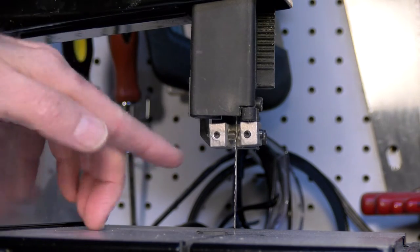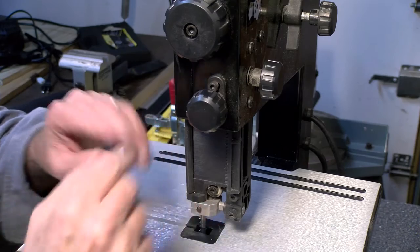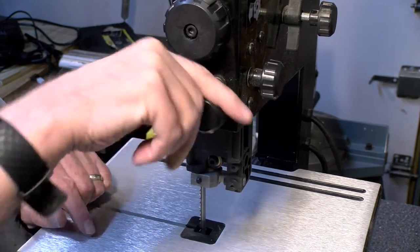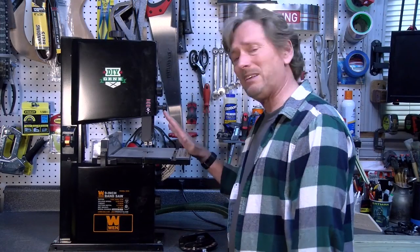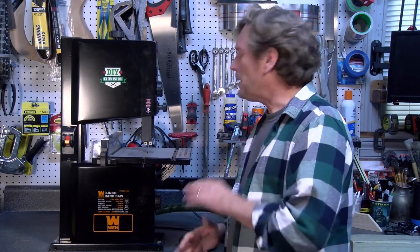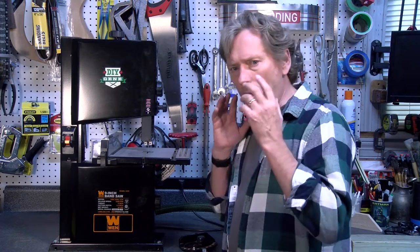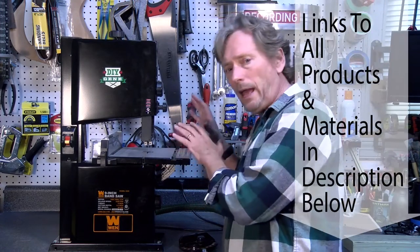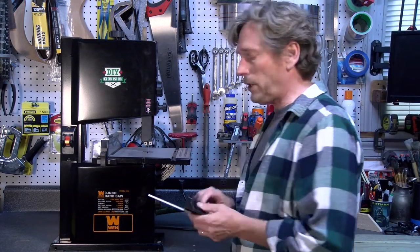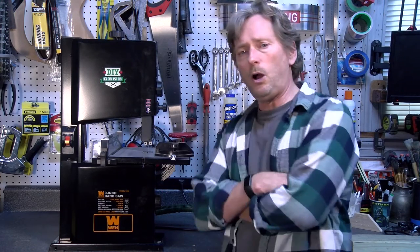Besides the tracking, you can fine-tune the blade back and forth with a set of allen keys on the front and side. To raise the blade, you loosen the back, raise it to the height you want, then tighten the back. The biggest thing about a bandsaw is they're a fantastic tool so long as they're set up right. But if they're not set up right and not tracking well, they're a bigger pain than any tool I've ever used. This one has not been that issue — it adjusts easily and very well. It also came with a miter gauge, which I've used on a few projects.